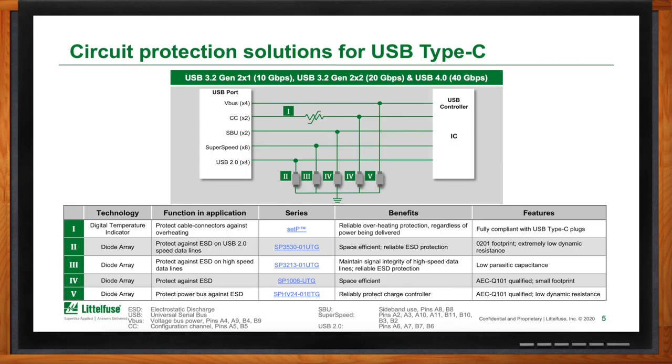At the top of the chart at Roman numeral I, we're trying to prevent over-temperature issues — different from the other lines. Overheating faults can severely damage electronics utilizing the USB-C port. The Set-P device senses overheating and, even though the overheating occurs on the V-Bus line, its unique position allows it to cut off power on the CC line when overheating occurs. Set-P can go in a device just like the ESD protectors on the receptacle side, but today only on ports utilizing USB 2.0 lines. When super speed lines are needed, unique system requirements require the Set-P device to move from inside the device to out on the cable.